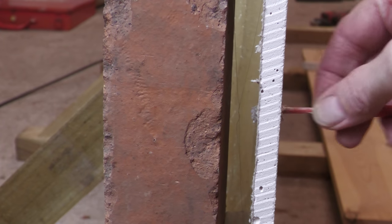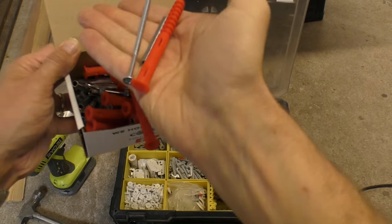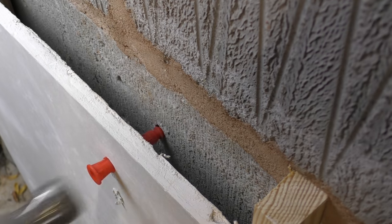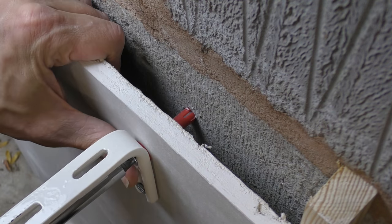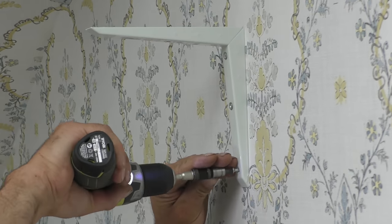If there's a small gap, test how deep it is with a screwdriver or a long piece of wire. Whilst there are fixings that can open in very tight gaps, by far the best thing in this situation is to drill right through into the brickwork and use something like a Core Fix. The beauty of the Core Fix is it has a steel core which bridges the gap between the plasterboard and the brickwork, so when you tighten the screw it doesn't pull the plasterboard back towards the brickwork behind. The maximum depth for a Core Fix to operate — from the outside face of the plastered wall to block work — is 45 millimetres.